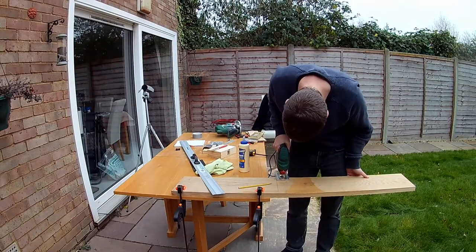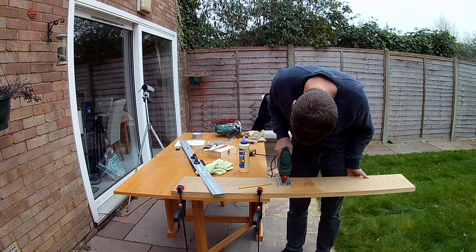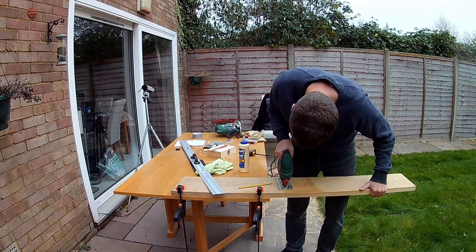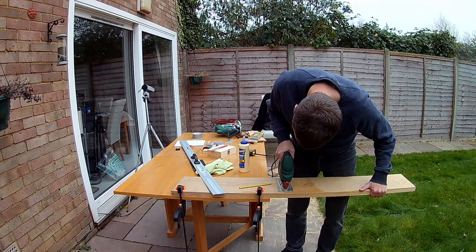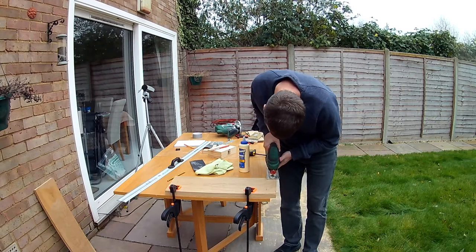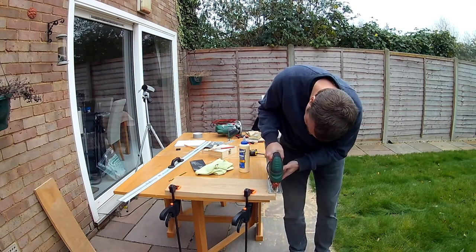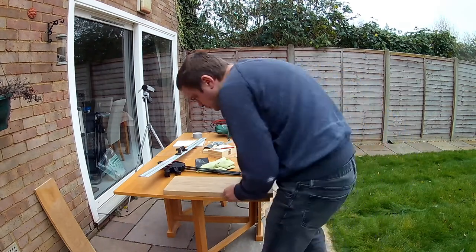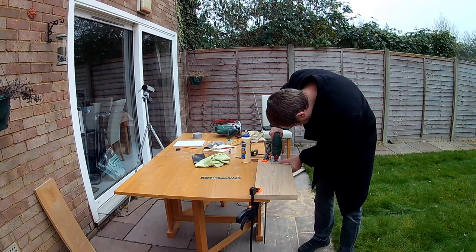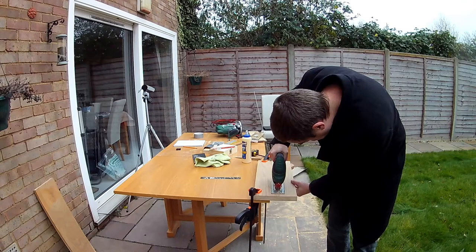While I was waiting for the glue to set I started work on the side panels. These were to be made out of some much thicker oak that I'd bought with the intent of making a table but without a deadline I just hadn't got round to it. Much as before, I measured and then rough cut it with the jigsaw. This wood was much thicker so I went a bit more slowly. After cutting it to length I flipped it round and took the other end to roughly 90 degrees to the side. This piece was to make both side panels, so I measured and cut it lengthways as well to slightly over the final required width. Again, all jigsaw cuts I was considering to be very approximate and intended to tidy them up afterwards.